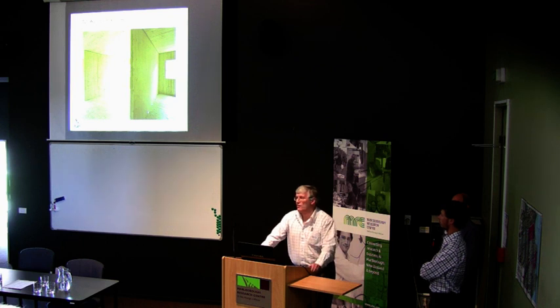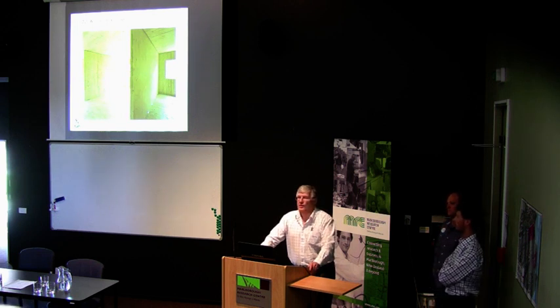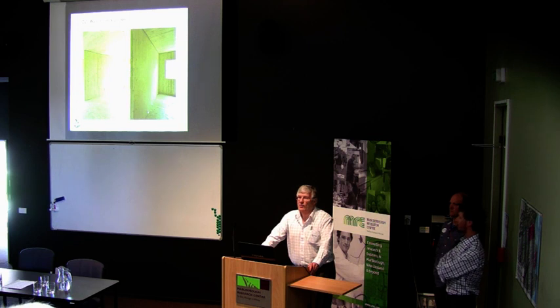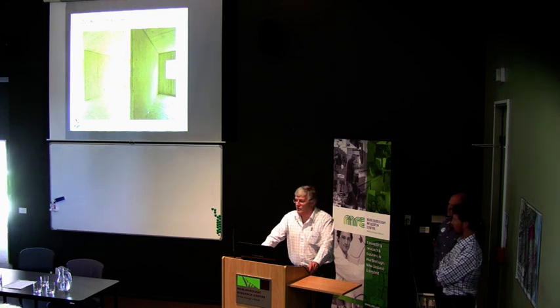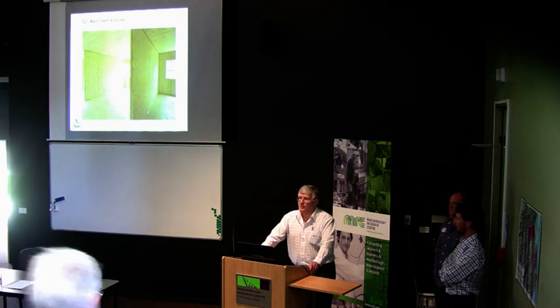It's a great solution for buildings where the use is not expected to change radically during its lifetime. It's not what you'd use for a retail complex where you might want to convert from a car showroom today to a doctor's surgery ten years from now when the lease ends and the building has to be reconfigured. But for an apartment building, a student hostel, an old people's retirement village, certain kinds of educational buildings, hotels — anything like that — this kind of structure is absolutely perfect for CLT.